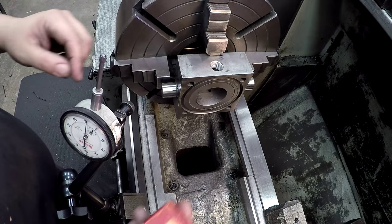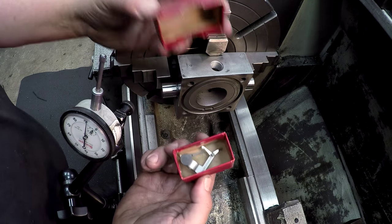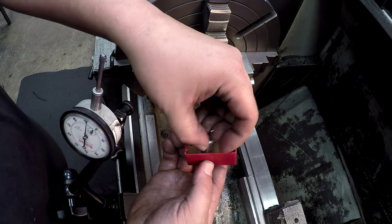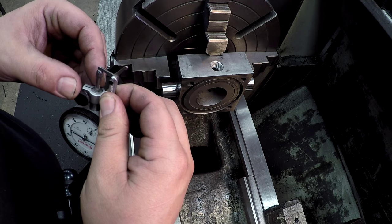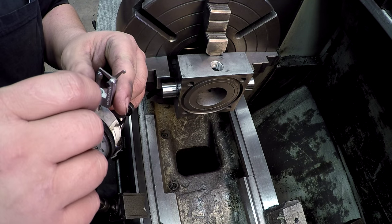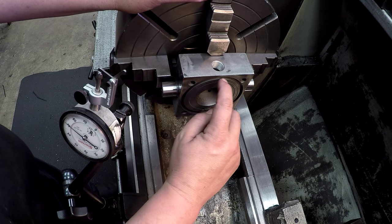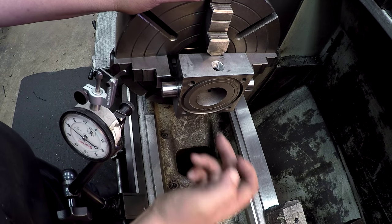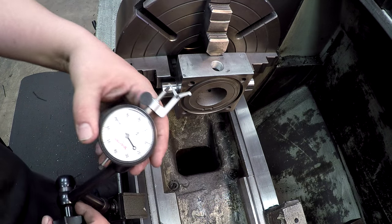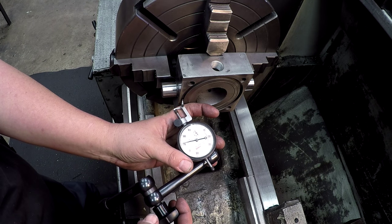All right, James Green, you're gonna like this. This is the number 671 that I bought from you back at the Bar Z Bash. Nice little indicator attachment that we use once in a while. Put this down here on the indicator. Okay, so what I want to do is reach in here and indicate this O-ring groove that's been machined in there. That should be true with everything, okay? With your rod, your tube, and everything. So we'll get this set up and get up in here.